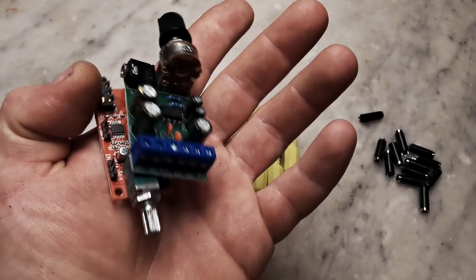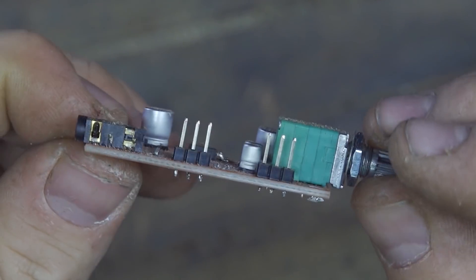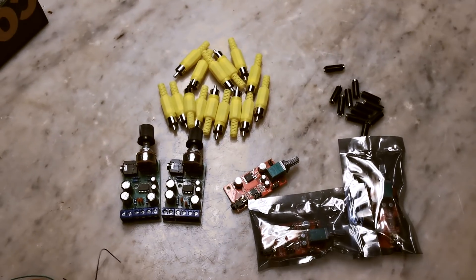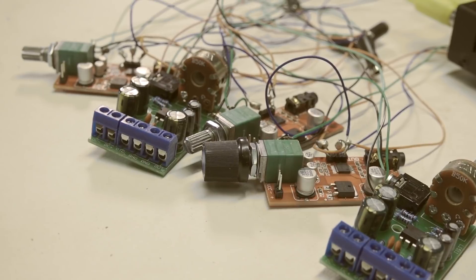This is a 3.5 millimeter jack, which is the same dimension as the jacks on the headphones. I bought some of these preamp circuits — they have an audio in and audio out, so the little circuit will boost up the volume and control it very clearly. I bought five of these. My plan to control the volume is to use some little preamp PCBs — these are very cheap circuits, you'll find the link below. With this I have two advantages: first, I have knobs to control the volume; second, I can boost up the volume so I can listen much more clearly to very faint sounds, even if the enemy is very far away or just walking around me.